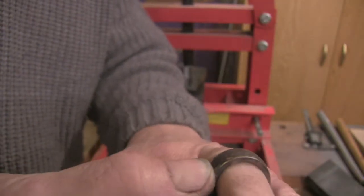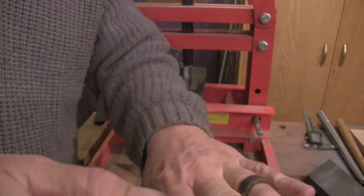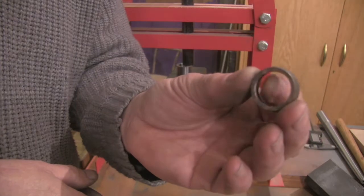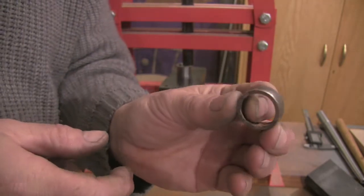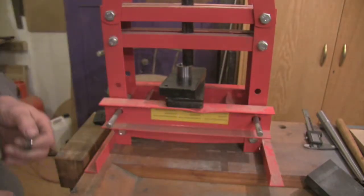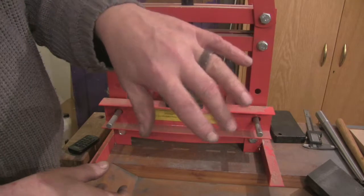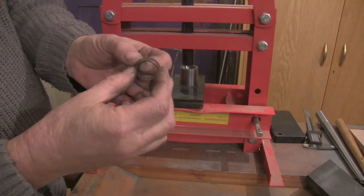because when you have got it on your finger, I'm going to have to open this up a bit to fit that finger if it was for that finger I was doing. It's less obtrusive on your actual fingers, but I'll do the same thing again, but with the 17.5 degree folding cones, to show you the difference in the actual barrel. So that's the 10 degree. Opened it up a bit. Now basically I can get it on that finger. Not that there's any point to that, I'm just showing you how to do it really.